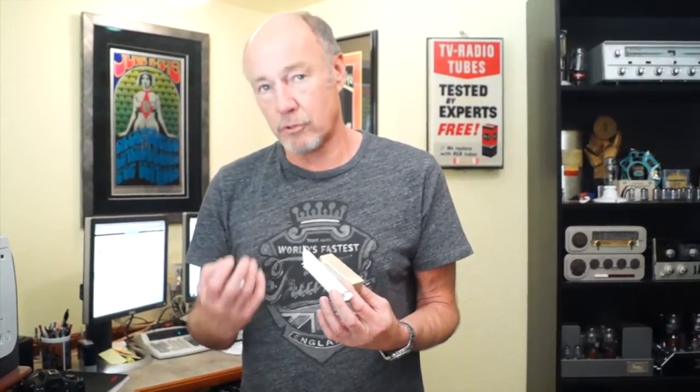That was the good news. The bad news is, when I went to test them, many of them were noisy or microphonic, and they had a triode that dropped out or was very droopy, one or the other, and it would actually get worse with some use. Older tubes, just because they're old, doesn't make them better — it's like an old Toyota is better than a new Toyota. Don't assume that. There are some very early tubes that were incredible, but many times they were just learning how to do it and didn't get it done right, and this is that case. They don't sound that great — they're kind of noisy, kind of microphonic, one triode is droopy.